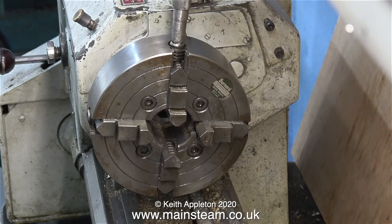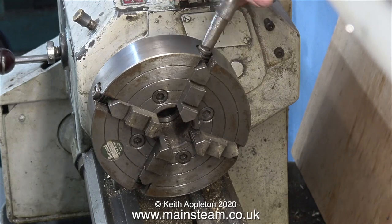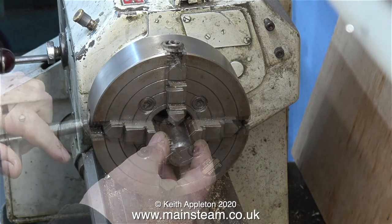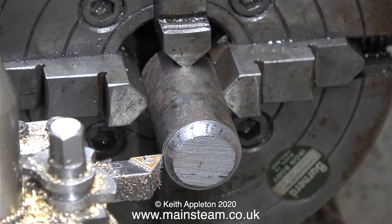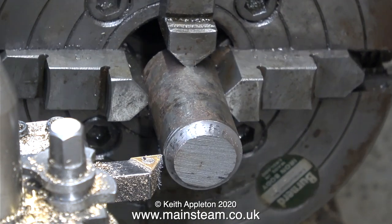The alignment begins. I'm adjusting each jaw until it goes midway between the two outer lines, and the four jaws should end up being equidistant from the centre. Here's a piece of steel going in place — a quick nip up of all the jaws to make sure it's tight. By rotating the chuck and advancing the lathe tool towards the work you will find out whether it's in the centre or not.